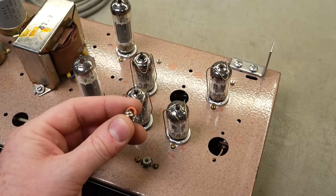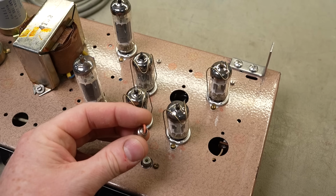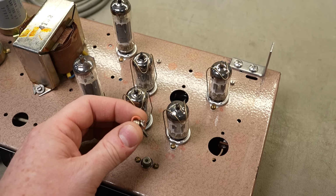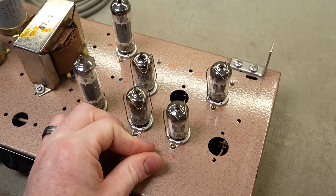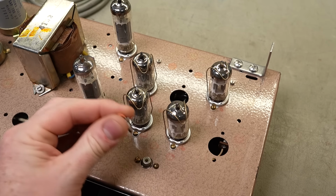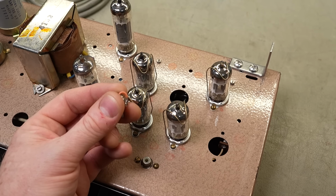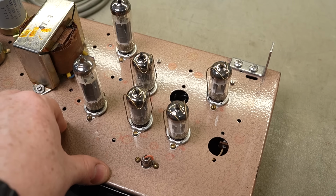And it looks like that's maybe the answer for our foot switch. They've just soldered it back on itself to make the tremolo always on. So that must be like connecting the cathode to ground kind of deal, as opposed to shunting the grid to ground. So point being, some Fender amps, the tremolo will be active when the plug's shorted, and then other ones will be inactive when the plug's shorted. So that tells us a little bit about the trem oscillator, tiny bit.